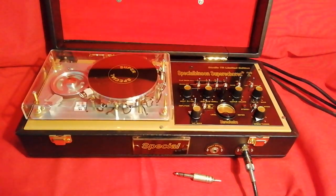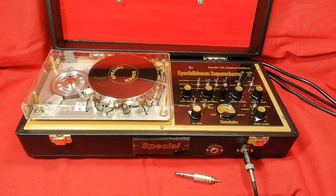Now I will turn on the light in order to explain you a little bit about the unit. This unit, like the other one, is a stereophonic unit. I call it Stereophonico. By combining the input signal through two independent channels on a single disk, interacting between the right and left channel, it creates a synchronized stereo effect that allows for a wide range of stereo possibilities based on the choice of disk speed and head selection.